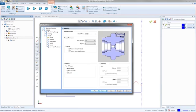Now we don't need to get rid of that geometry. We come in. If you check mark where it says remove primary undercut, BobCAD is ignoring all turn grooves. If you put a check mark on remove secondary undercut, we're removing all face grooves. So as you go through this, if you put check marks on both of them, you're avoiding turn grooves and face grooves. I can't, for whatever reason, I'm blanking. I just cut this part last week. I don't think it leaves out angled grooves. I think it's just strictly turn and face. We'll find out when we compute this. But it may leave out the angle groove. I can't remember anymore. So right here, then there's our constraints.